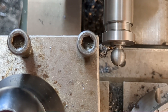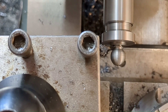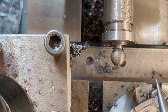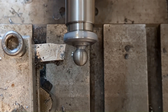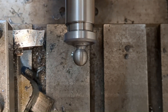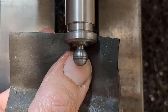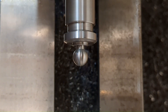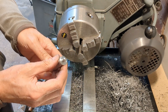The slot hasn't come out perfectly so I'm going to clean it up a little bit afterwards. I've put the 30-degree chamfer on the other side by touching the corner and coming in a known amount on the cross slide. I'll give this a quick polish and leave it on the arbor, because we're going to need the arbor for holding this on the dividing head on the milling machine for machining those flats.